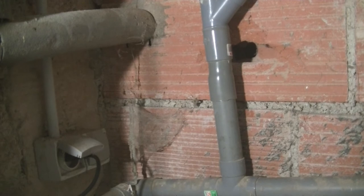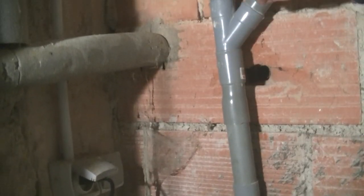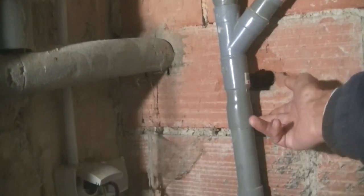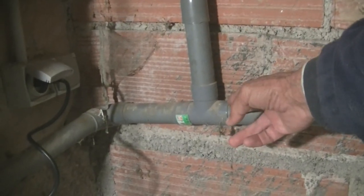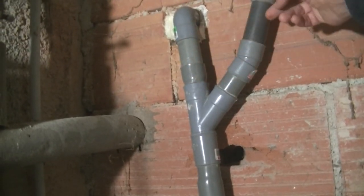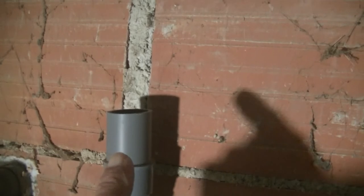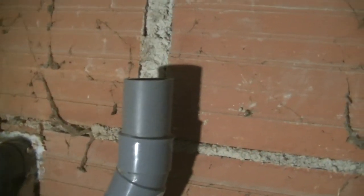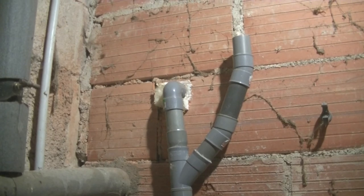I apologize — yesterday when I connected this part over here the camera didn't work properly. Anyway, it's exactly the same as that one up there — I just put the PVC adhesive inside and joined the two pipes. So now when the bathwater comes rushing past at the bottom it's going to cause a vacuum in this pipe, but it's not going to siphon the water from the washing machine — it's actually going to draw in air through this pipe. When I go to town next week I'm going to buy a special vent cap which fits on the top — it has a one-way system which allows air into the pipes but doesn't allow any poisonous gases out.